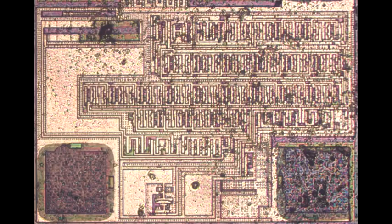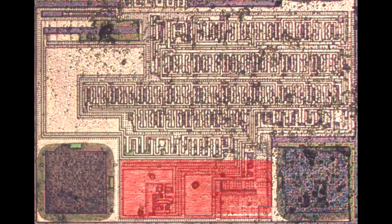With the pleasantries out of the way, let's actually analyze the chip's functionality. You might be wondering why I'm analyzing such a goofy thing — I thought it might be an interesting look at what happens when a designer is given basically no money. With a sell price so low, I have no doubt there's probably only three to five cents allowed for the silicon die, which meant the designer had to be very clever in their use of silicon. The large metal structure I've highlighted I strongly suspect is a capacitor — you need some timing function on this die to create an oscillator for that blinking pattern. Below the two pads there's a sequence of other analog-type functions: there might be a small voltage regulator, a reset circuit to get the thing to start up properly, and then a whole bunch of logic gates.